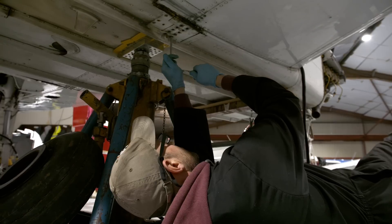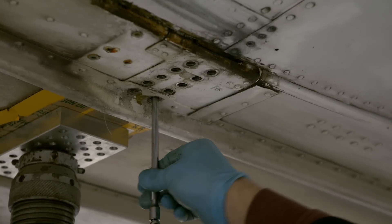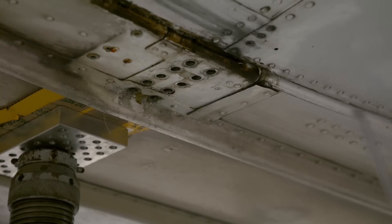It's all very reinforced under there because it's retractable as well. There's a big gear well there, so there has to be a lot of reinforced structure to the skin in that area. Unfortunately, the only way to repair it is to remove the wing and replace that section. And it gives us a good chance to have a good look in there as well — there are areas you really can't inspect thoroughly unless you have the wing off. The aeroplane is new to us and we haven't seen it in for an annual before, so it's a good excuse to have a good look as well.